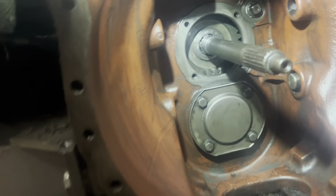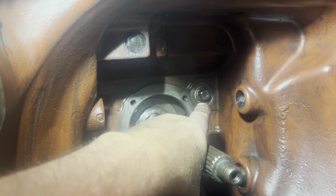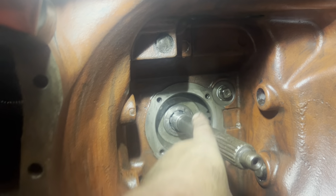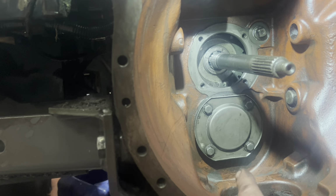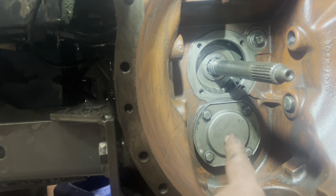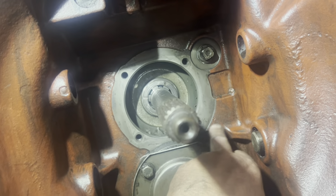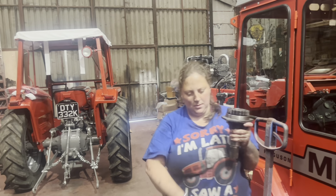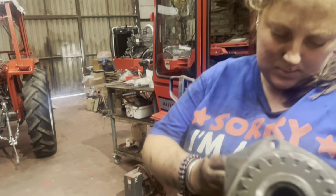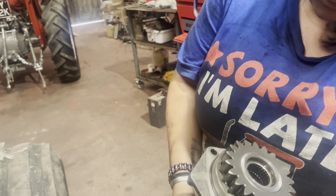That's had a pretty good clean out. We did take that plug out there, clean it up, bit of PTFE around it, just to be sure. Obviously everything seemed dry around there. I've checked the bolts, they're all nice and tight, but as I say, the oil was from up here. So the apprentice has cleaned off the big shafty thingy. We'll get that reassembled in due course with a bit of instant gasket around it, just for belt and braces.